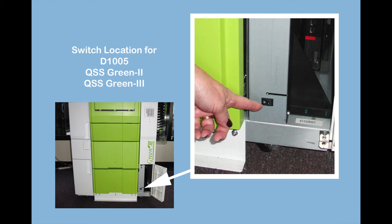It is important to note that if the humidity control unit is used incorrectly, it can intensify unwanted effects on the paper. When used correctly, it will help control the humidity level inside the printer. Your local Noritsu representative will be able to guide you as to when to turn the humidity control unit on or off, as this varies according to unique local conditions.